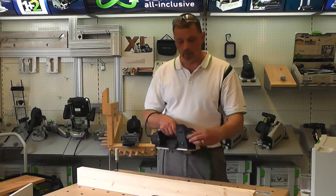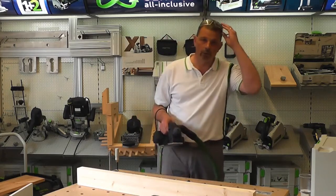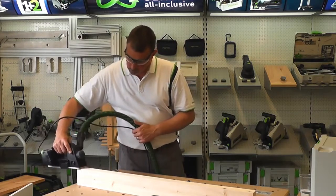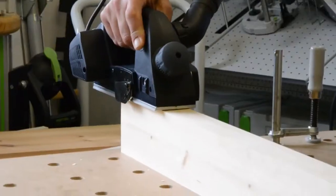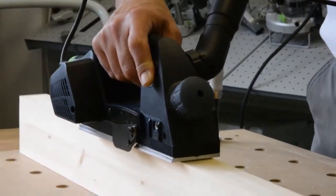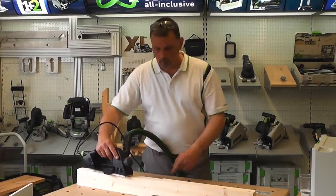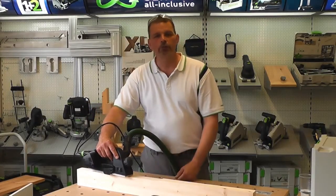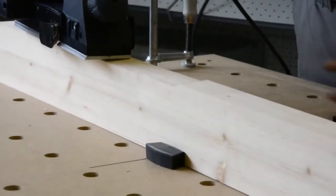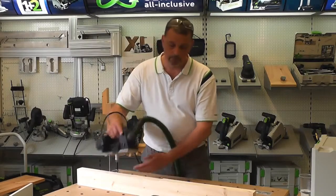So now let's crank it up. We go to 4mm, the maximum depth of cut, and we'll see what progress we make with this. So you can see it's a huge amount of material to remove for a small machine. However, because I'm using a draw cut blade, I can then go back onto this cut and complete it and not leave a mark behind.